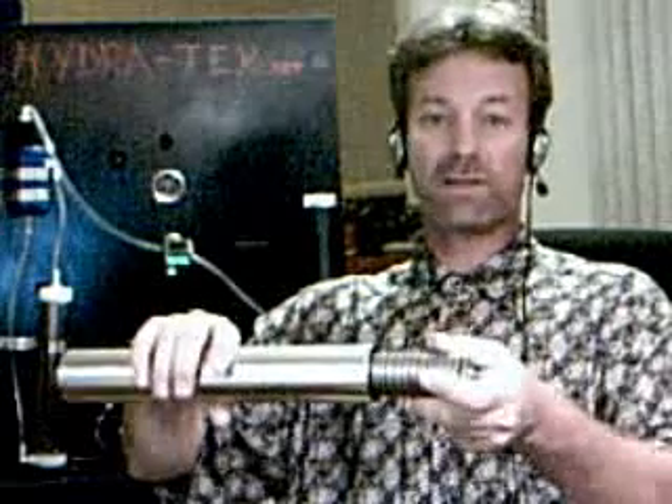The caps have been removed so that you can see the inner tubes. You can see that what you're getting is not a stacked washer design, which is very inefficient. When you put a stacked washer design inside of a tube, what you effectively have is a parallel cell, which puts 12 volts through the electrode into the anode. That's very inefficient. At 13 and a half volts, you're wasting 12 volts, and the waste is in the form of heat from the excess amp draw.